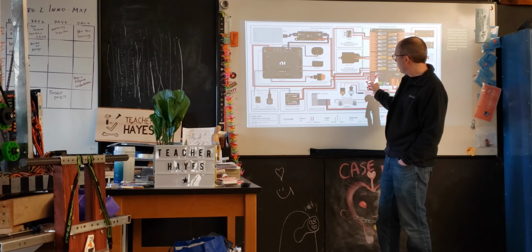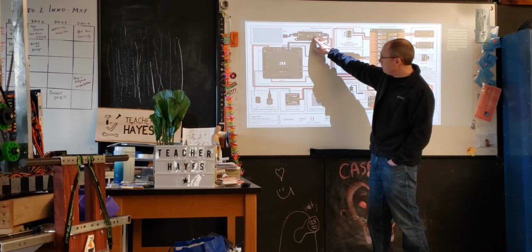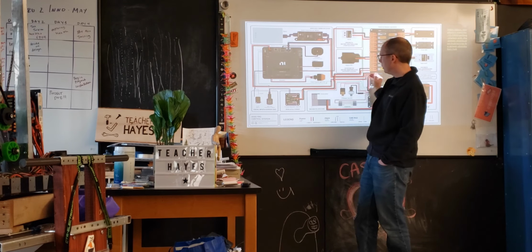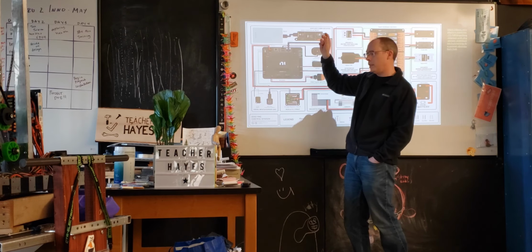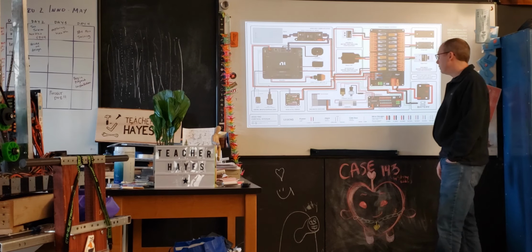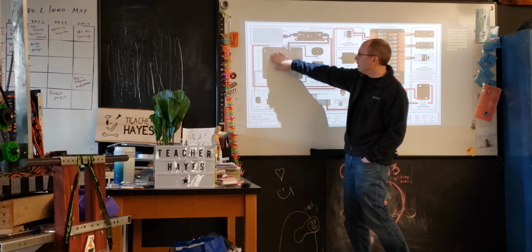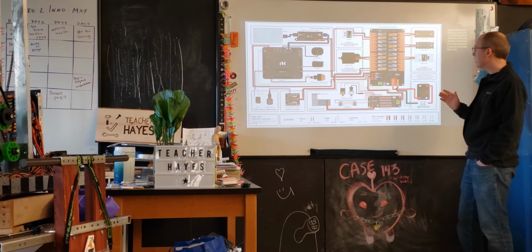I don't remember if we can look on ours, whether we power off here or off there, the radio. So we have a radio. The way we power the radio is through power over Ethernet, and this is a voltage converter. So a voltage is coming from here. It's putting that voltage onto the Ethernet cable that then powers the radio. So the key components that we have in our system, of course, battery, the PDU, the RoboRIO, and radio. Those you basically have to have on any robot, right? That's the basic pieces that are inside.